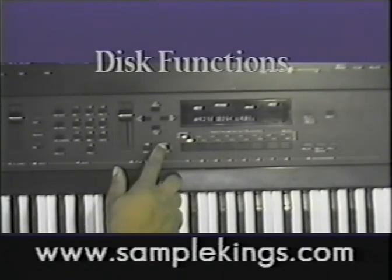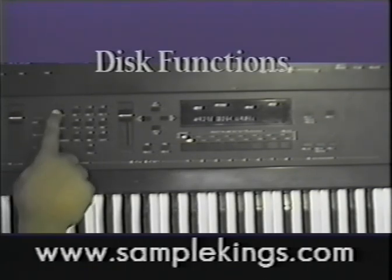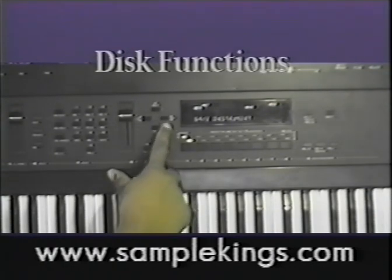Okay, now that we have our formatted floppy diskette, let's save our samples to disk. To do this, press Command, then Instrument. This page contains all instrument-related commands. Select the track that you would wish to save. Press the left or right arrow key until the display reads Save Instrument.